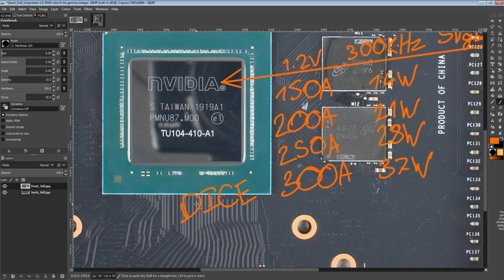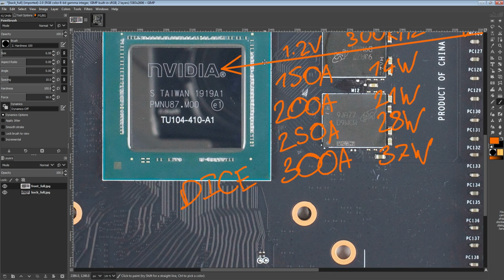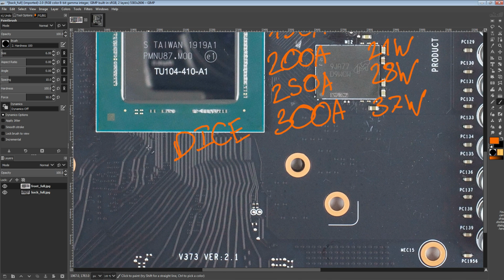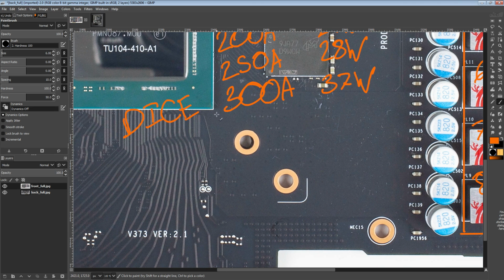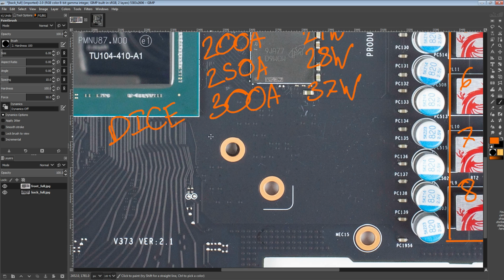If you run more voltage, for CPUs and GPUs, the relationship is basically a linear increase in actual current draw. And then there's a linear increase in current draw from clock speed. So you put those two together and you rapidly start pulling significantly more current, especially if both the clocks are higher and the voltage is higher because the temperatures are low. So yeah, you'd need dry ice cooling at the very least to start approaching this figure. It might very well be in LN2 territory.